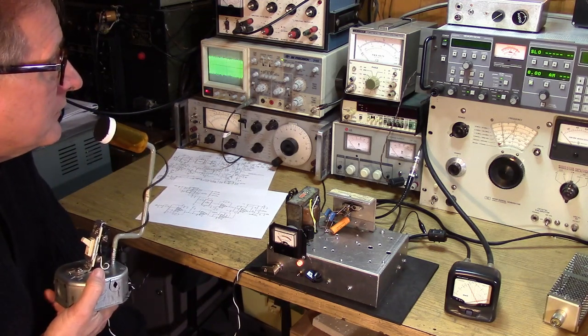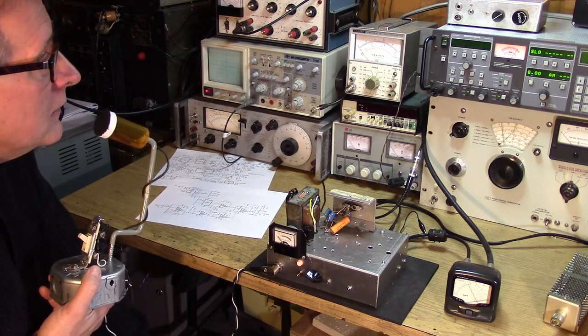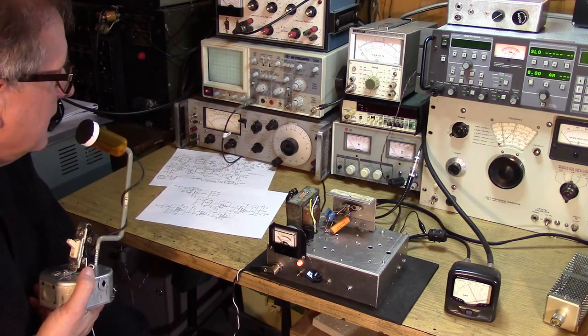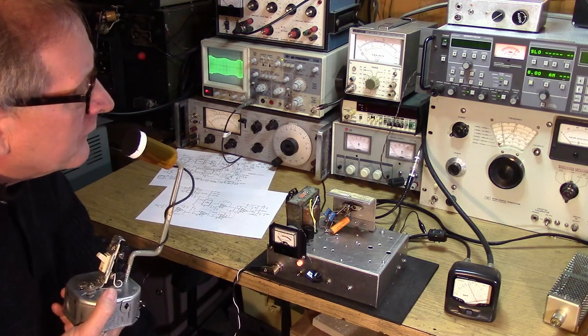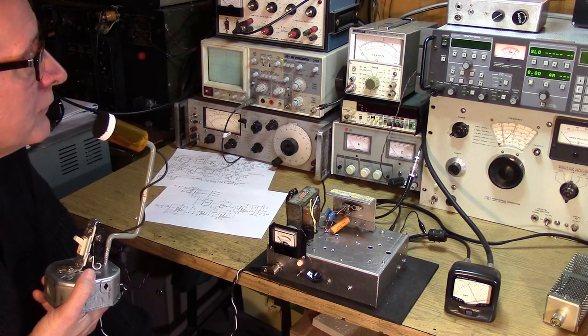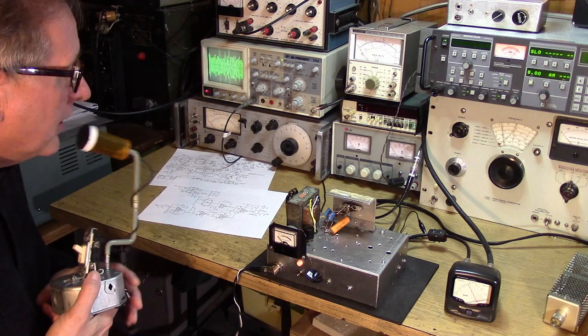You're not going to upset these transistors, and I can always change the IRF 510 to something a little more stout on the voltage side. You kind of need to have 3 times the voltage rating on the transistor than you're running, so you start to have to use the higher voltage devices. But still, those are a dime a dozen now, Tim. Over.